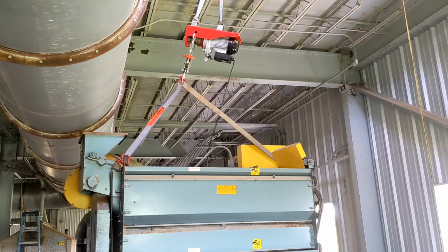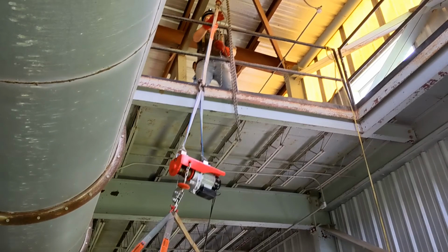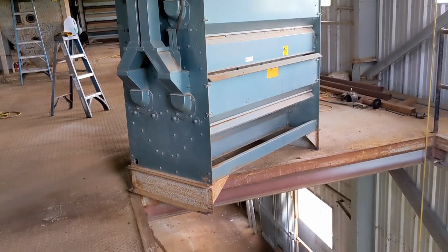So Ezra just got up with the clevises we needed. Let's get rigging. We have the 612 lifted in a triangular pattern, technically. We're around those two shafts over there. Luke is hoisting it out over the hole, and we doubled up with our snatch block just to be safe because I believe this is the heaviest machine that we've hoisted so far.